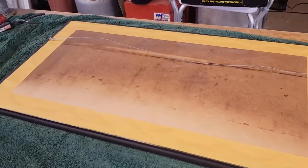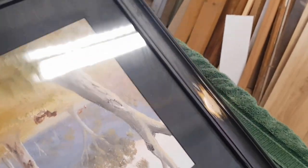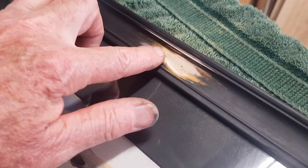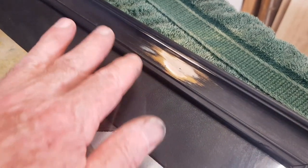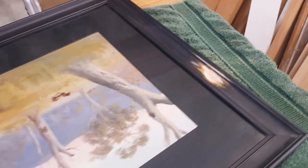All done and ready to hang — except we had a bit of a problem. The little screw eyelet I put through was a little bit long, and because this frame has a sort of concave section it wasn't as thick as I remembered, and it poked through and made it look terrible. I've had to sand it back, fill it with a bit of putty — it's nice and smooth again — so we'll give that a touch-up with the spray and then this one is finished.